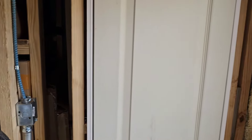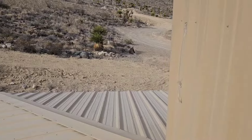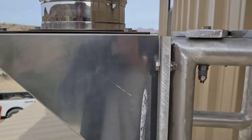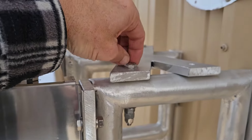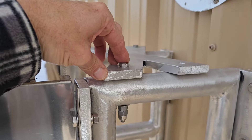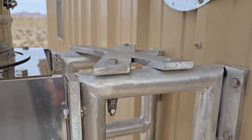I got a little sidetracked — I went outside and finished putting that bracket on the flue for the wood burn stove. The bolts I got for it were a little too long, about to get some other bolts, but it's definitely solid, not gonna go anywhere. I broke one of the bolts and ran the nut on about a half inch, and I couldn't get that thing back off for anything. It wasn't cross-threaded though — the threads just galled up in there. So I'm gonna get some more bolts — stainless.